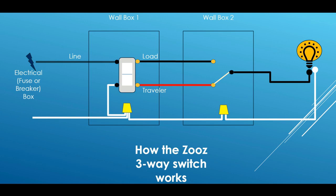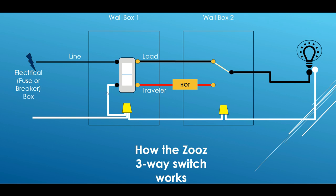If you're upgrading from the Zen 21, Zen 22, Zen 23, or Zen 24 in-wall smart switch, you need to know that the wiring does change. These wire in like normal three-way switches, but if you're upgrading from those older models you'll need to change the wiring back to normal. It is going to require a neutral wire — if you don't have a neutral wire in the box, this thing ain't gonna work. Go to my website's how-to section for information on how to figure out your wiring. If you try to wire it the same way you wired the old ones, things might go boom.